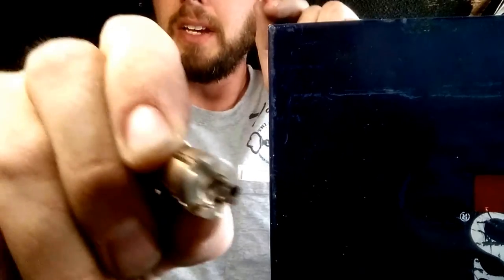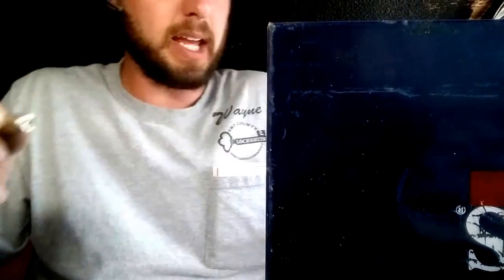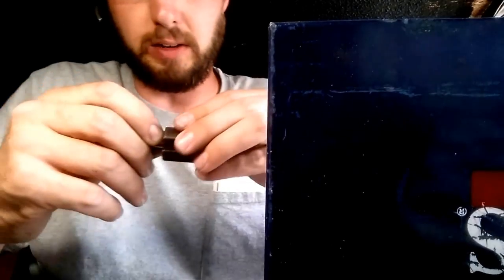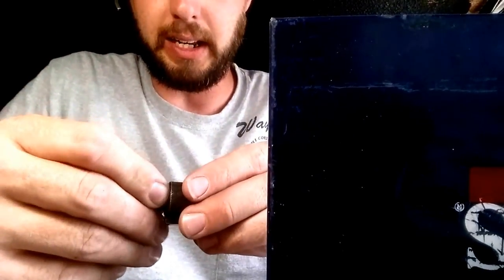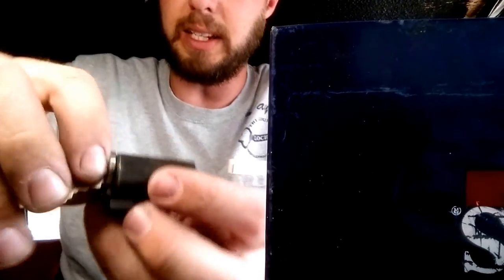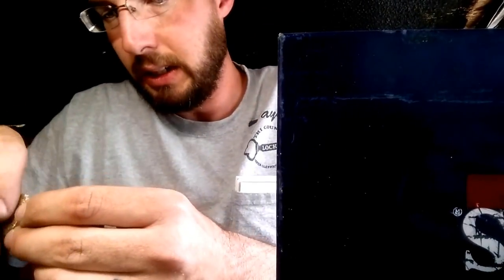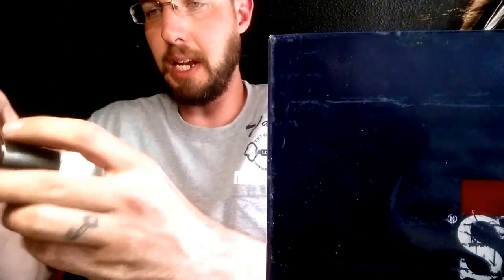Spring in, spring out. Okay, so this is where you're going to be at when we can now insert that into here and go ahead and pin the top pins as well. And then we can take this key out and the pins won't blow out everywhere. Very nice feature. So we'll go ahead and put that in there. We'll key up the top pins